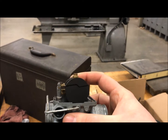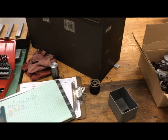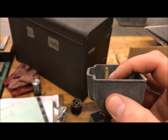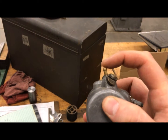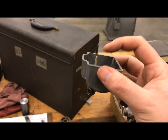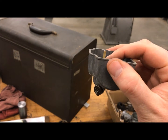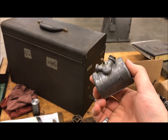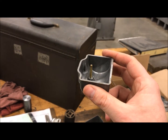That didn't change the fact that the float valve itself could not close because of the drastically incorrect float setting. So the bowls filled with gas. Inside the bowl there's an overflow spout — when too much gas gets in it'll run out this tube, which has rubber lines that go down underneath the bike. When they siliconed the seal shut, the gas had nowhere to go, so it filled up and went down the overflow tubes. Then they siliconed those shut too.